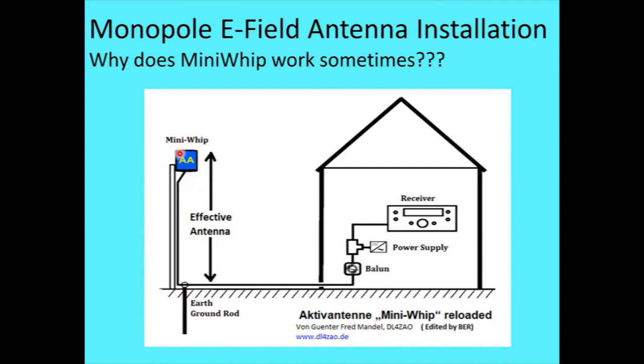It turns out that even if I turn this antenna on its side so it seems to be horizontally polarized, it's not, because your ground path is the majority of your antenna. So you'll turn up with a little horizontally polarized component in there, but not what I was looking for.